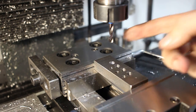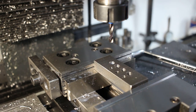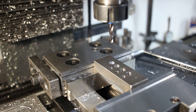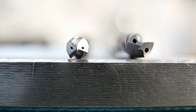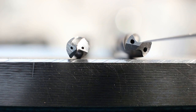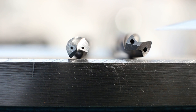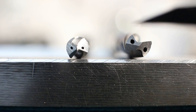So you would use this drill with a spotting drill if the web is not thinned. Otherwise it tends to walk around a little bit. So I wasn't too happy with the grind on this right drill with the unthinned web. They work, and I used them before, but it's not perfect, or not as good as I would like it.